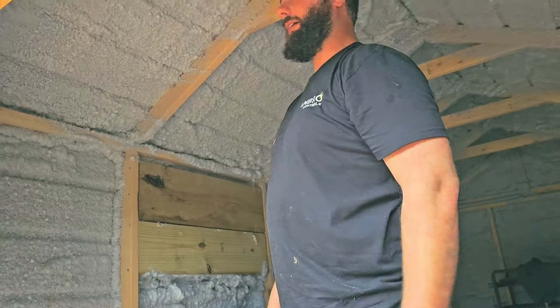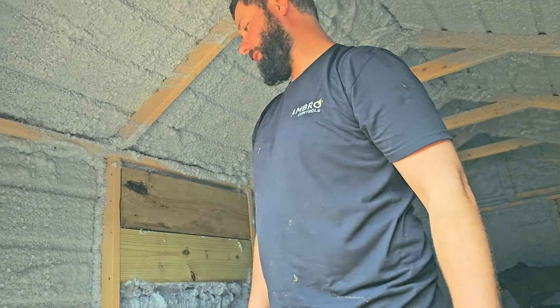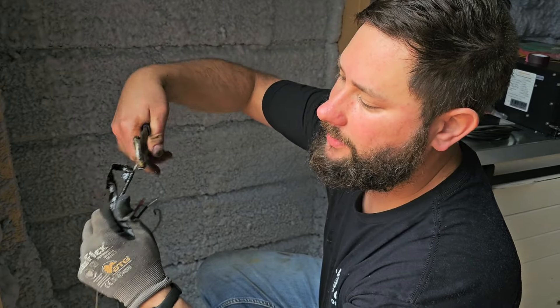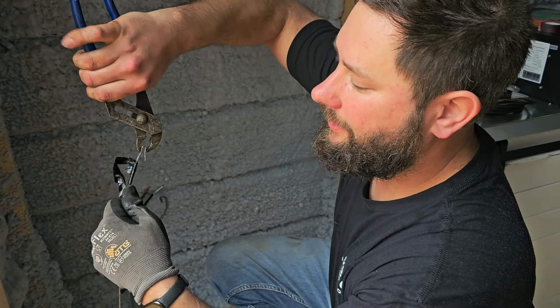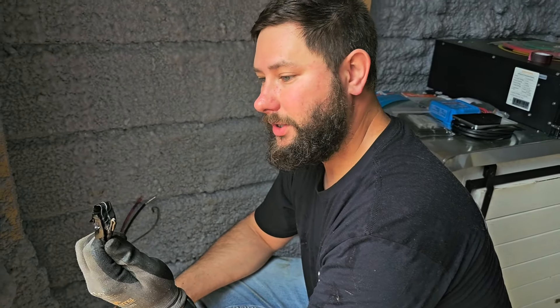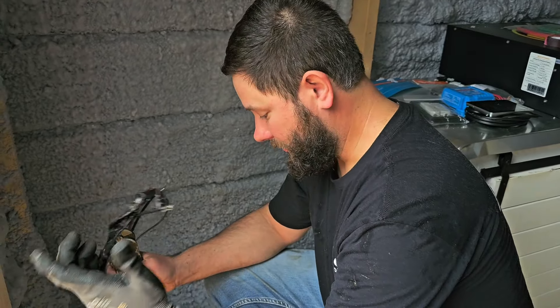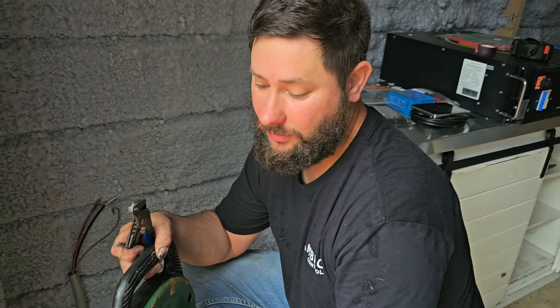I need the silver wire to be longer — we just barely made it, so I might put a little junction box there. You'll notice at the end of the fish tape there's a U-shaped end. You can cut and reshape it, put your wire in between it, and crimp it down to help hold the wire. There are different secrets of the trade — electricians know best. Fish tapes come in different sizes and lengths, so check out the various sizes online.